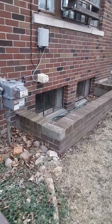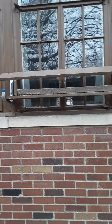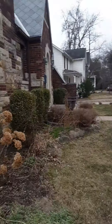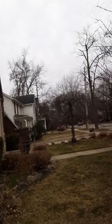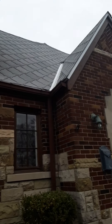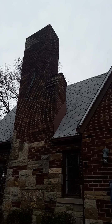Around the front there's not too much. This side's in pretty good shape — got a little bit of caulk there, it's $50 to grind that out, rinse clean, refill with proper mortar. The chimney's debatable. You could use some work on it, but it isn't the end of the world. You could fill a couple holes up there, make it look a lot better. Otherwise it needs grinding in about a belt around it, about three feet high, all the way around — it's pretty weathered. We put the stones back up on top of the chimney there — that's sandstone — put those back up, that's $350.